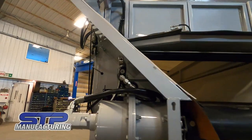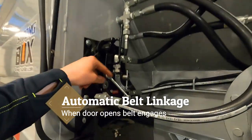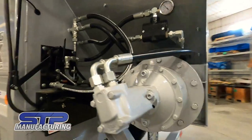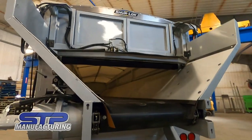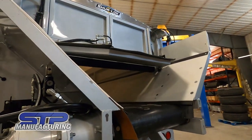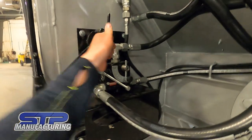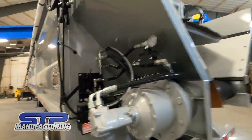The whole rear door is also run off this mechanism — when that cylinder raises and the door opens up, it slowly pulls the valve open and lets the oil through and turns the belt on. So for sugar beets or lime when you're dumping in the middle of a field, you don't have to get out of the truck to engage the belt. There's also a manual override so if you're backed up to a grain bin, elevator, or potato bin, you can pop the spring out and turn the valve manually. This is a zero-to-ten valve with a flow divider and standard flow control.